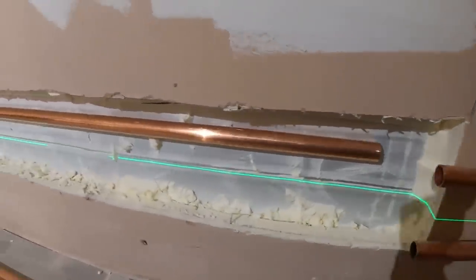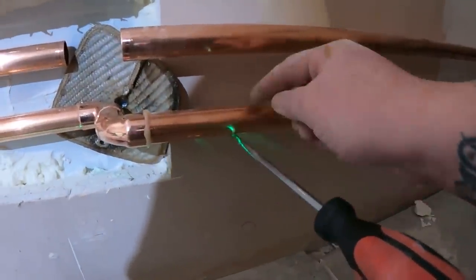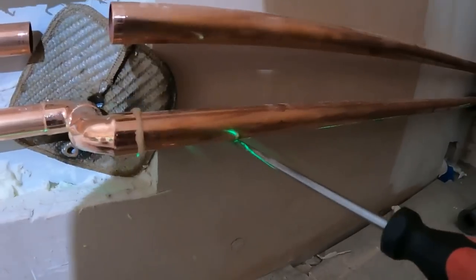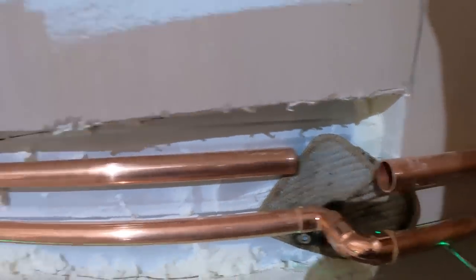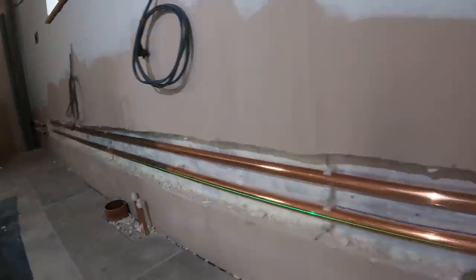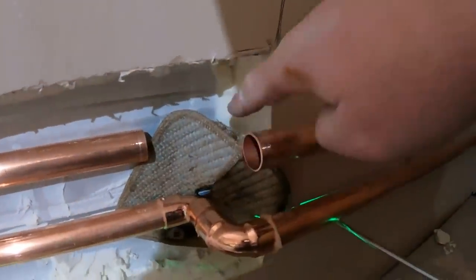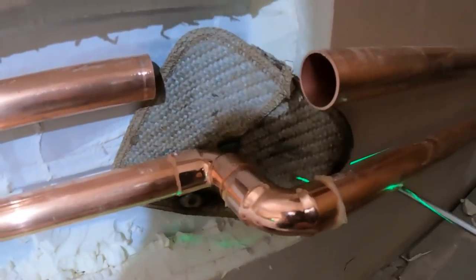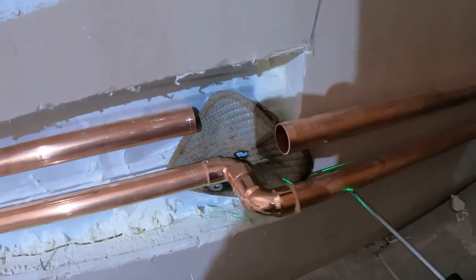Hopefully the week gets a bit better than that. The old screwdriver hack — push the screwdriver into the wall just to hold the pipe in position exactly where you want it. We've soldered this one into place, soldered the top one into place, and then we can work the bottom ones in. I've got the heat mat there just because we've got this insulation membrane — a bit of insulation there — so we'll just take our time and solder that up, then get the other one done.